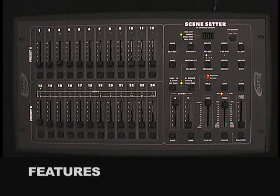Additional features include single and mixed chase playback modes, blind and dark functions, A and B master faders for two-scene operation, a tap sync button for chase speed and fade override, independent speed and fade control, full on button for 100% momentary output, a bright LCD display, audio input and internal mic for music synchronization, a fog machine trigger button for use with select foggers, and MIDI In, Out, and Thru connectors for external MIDI triggering.